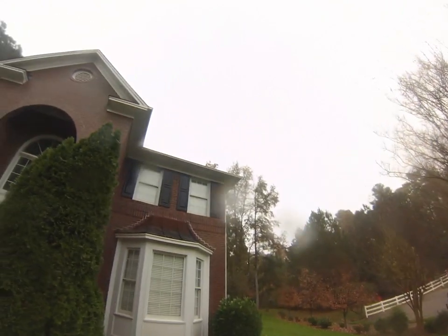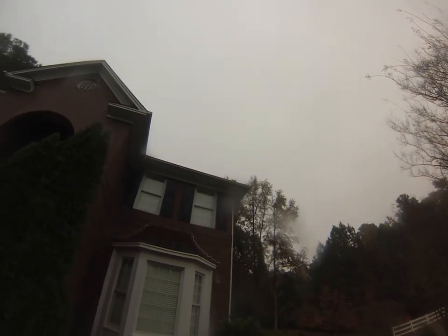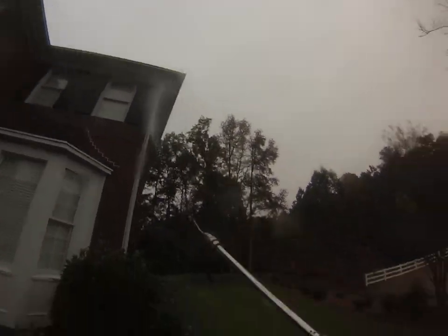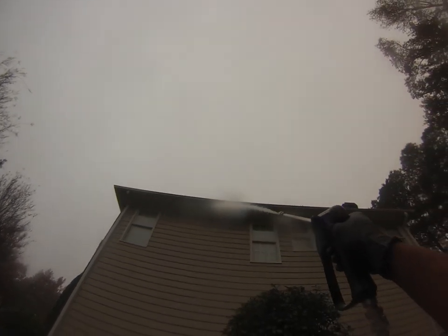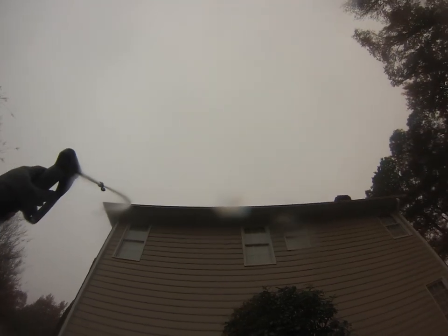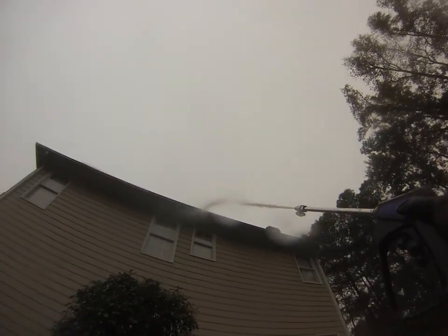So anytime you downstream, you always have chemical left in your line. So usually we have about 13 to 16 seconds of just chemical left when rinsing. So you gotta retreat with that in line if you absolutely have to do some retreating. Got a couple of spots. So now when you rinse from the top down. As you see, the soffit fascia area is cleaned up well on the rinse side of everything.